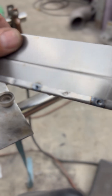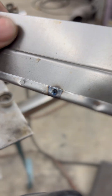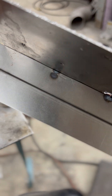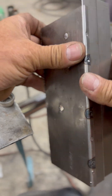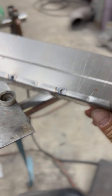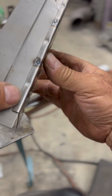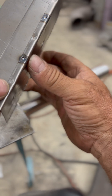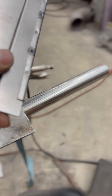Got a little bit of slag on that one, but it's still a nice dimple there. Heat on the back side and looks like it's nice and tight. So that's the Cass Norwaki version of doing a spot weld with the TIG — we just kind of sized it down for doing a quarter inch flange here.